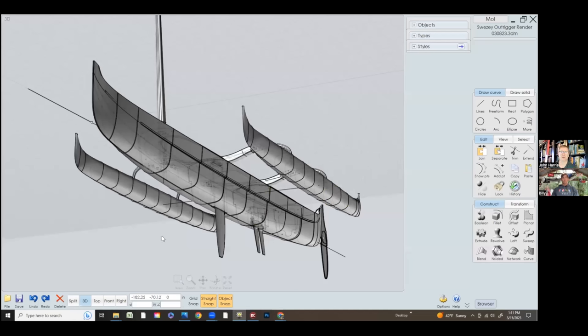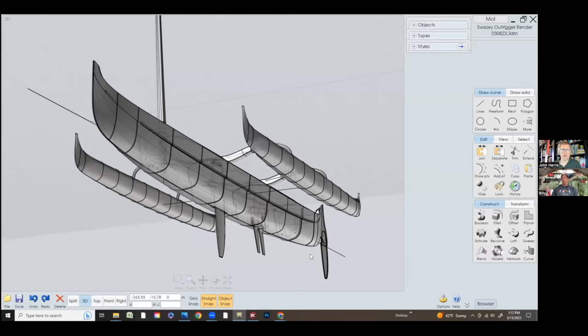John nailed the style we were looking for, and also seemingly the ideal balance between sailability and paddling performance. It all depends on the engine — whether it's literally an engine, a sail, or a human engine. You're not putting out a lot of horsepower paddling with a canoe paddle, or even with a Mirage drive. So you want a very easily driven hull. If you have a fairly fine entry, you'll use less power to get the boat moving at a good speed. As you start to pile on the horsepower, though, boats with fine entries and fine sterns in static conditions are going to dig up a deep balanced stern wave, which is slow. But when you turn on the power, you can definitely increase the potential speed and decrease the likelihood of a forward somersault at the bottom of a wave.